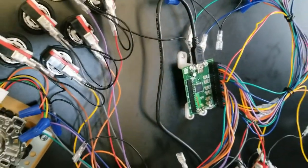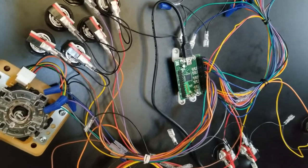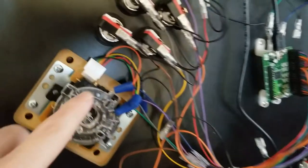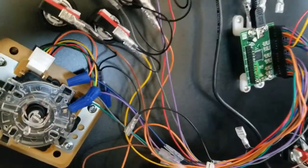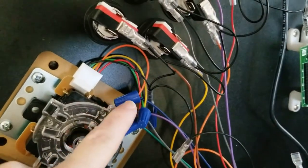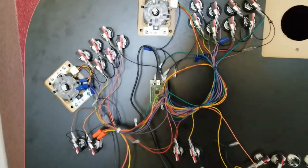So I had to learn a little bit about electrical wiring. Did some research on the internet and learned about splicing — you can actually splice wires together. I snipped off the end of the Sanwa joystick cables and then connected them to the ends of the harness wires using these little blue things here. You just twist the wires together, put the cap on, and it basically connects them into one wire. I'll show you step by step how to do that, but this one's all working.